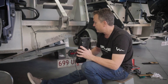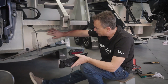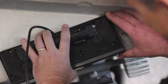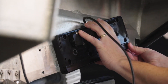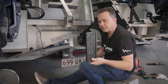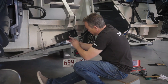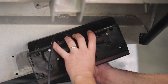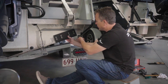We've removed the trim tab system off the back of the boat and now we're looking at how we're going to place these interceptors on the transom. These particular holes have a plate welded on and we've got a bit of an issue with height. To get all six screws in, we'd end up having the Zipwake Interceptor too far inboard when we want it further out for maximum roll leverage. So we're going to use these adapter plates — designed for a different purpose — which will allow us to mount the adapter plate further out, get eight screws into the plate, with no cutting or welding required. Then we can fit the Zipwake Interceptor to the adapter plate, positioned out where we want it for maximum roll leverage.